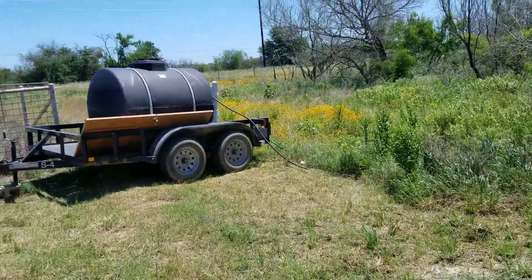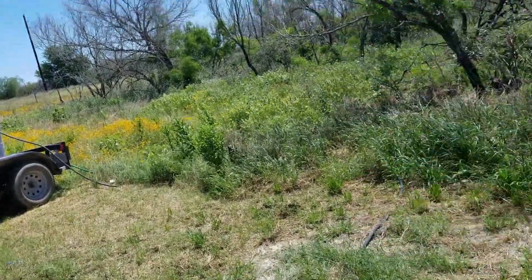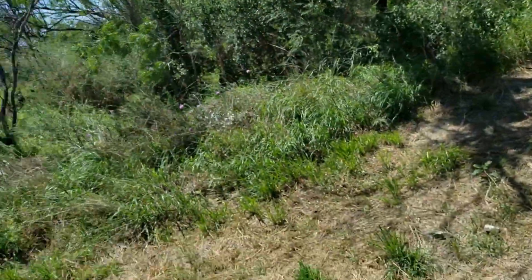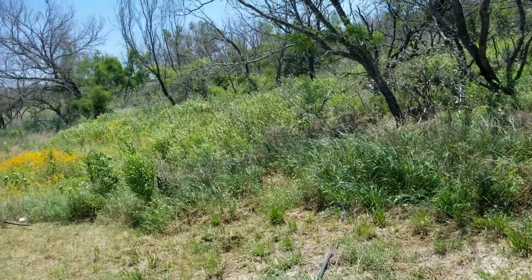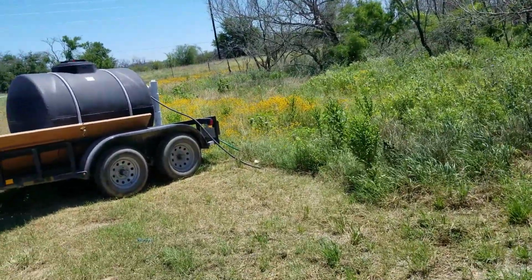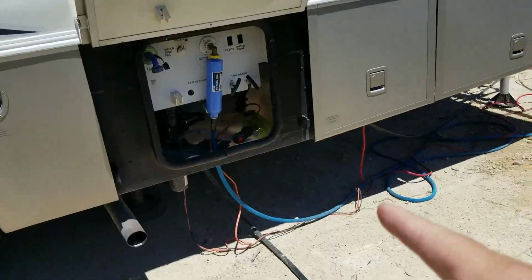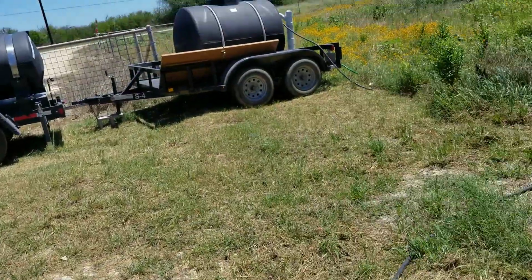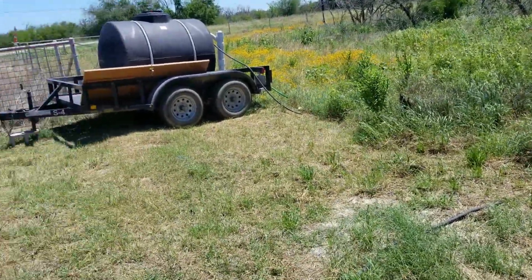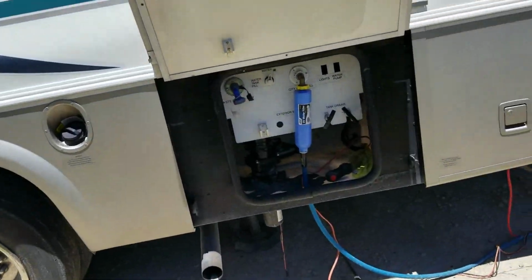So the beautiful thing about this, one thing that I'm excited for, is not only is it a lot cleaner setup than having a 3-inch hose hooked to a big honey pot pump that we had at the last one, but this pump has the ability to pump uphill. And this pump will actually pump this 50-foot length. You can go 75-foot, 100-foot, 100-foot slightly uphill. So with this macerator pump, it's going to come in handy.